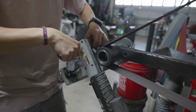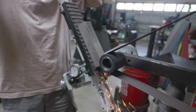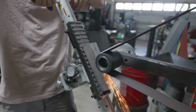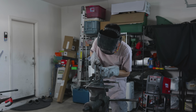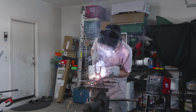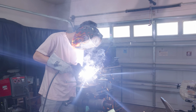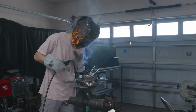If you look super closely in the last one, it was actually really important for me to only cut the first billet into 8 separate pieces. If I were to cut it into 9 separate pieces, the wiggles wouldn't match up as I stacked them on top of each other. If I had an odd number of pieces, the central wiggle would be a lot wider than I needed it to be, and they would be on the same side. So it was really important that I had an even number of wiggles in an amount that would make it interesting.